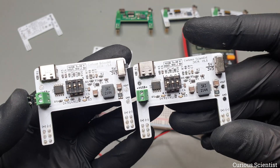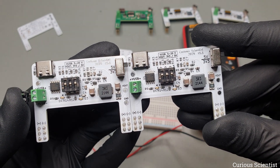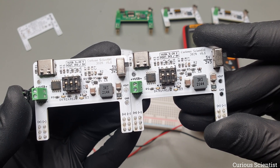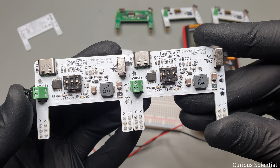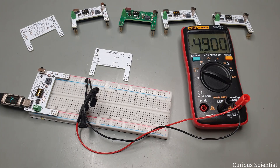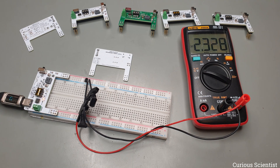As I mentioned earlier, initially I missed the fact that I needed another value for R8 due to the new wiring of the switch. I still had a batch of components from the previous project when I built the first version of this board, so I just automatically assembled everything with those components. Originally, R8 was 23.2kΩ. Everything worked, but the 3.3V rail constantly gave me 2.3V, which was very confusing. It took me a while to remember that I redesigned this part and needed another resistor for R8. Once I replaced the resistor, the values fell into their place, or sort of.